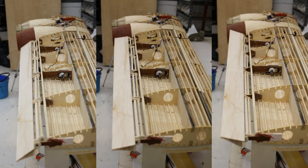So when you look at the aileron being deflected here, I normally on a model aircraft will go about 3 or 4 degrees farther than the real airplane required. I do that just because of a gut feeling. I know there's a big difference in the way the air molecules work on a real full-scale airplane versus a model, but when you get into this size of a model, we're getting closer to, I don't know if physics is the right word, but the realm of how a real airplane really is mimicked, I guess is the best word. But that's pretty much how the ailerons were set up. As I said at the end, watch the video. You can see them actuate, and they're pretty cool.